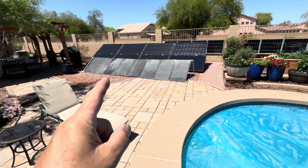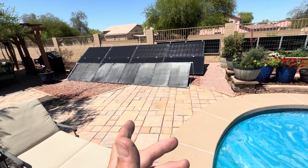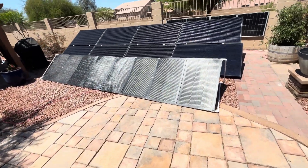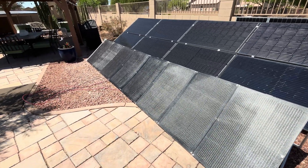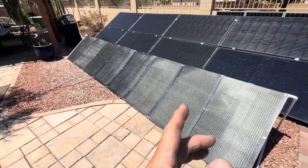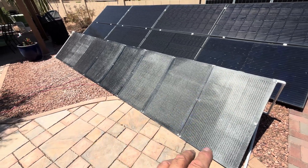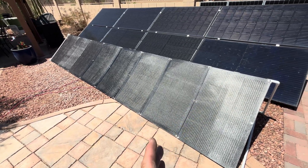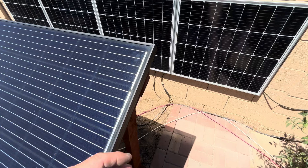A couple weeks ago, I purchased these 110-watt mono flexible solar panels. Those things can bend to like 270 degrees — very flexible. I have eight of these connected running straight into my EG4 direct solar input. These were pulling up to 700 watts out of 880 possible, which is really good. I only paid $58 a piece on Amazon, and I bought the three-year warranty with each one. A pretty insane deal for flexible panels.